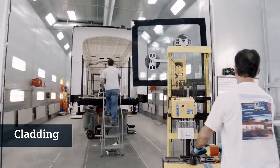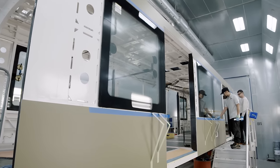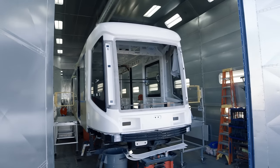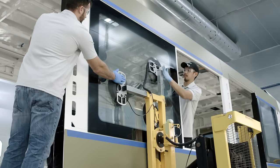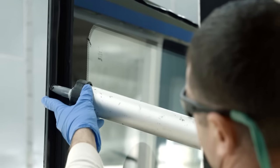After the flooring is put in, we take it into a cladding booth where we install cladding on the vehicle, which is the aluminum skin that goes around the outside of the vehicle. We also put the front mask on, which was another Calgary highlight, and is shaped in the form of a hockey mask. We also install the windows at this point, and these windows are a three-layer window to help the insulation factor and keep more of the cold out in the winters and the heat inside the vehicle.